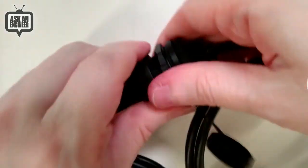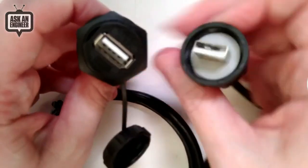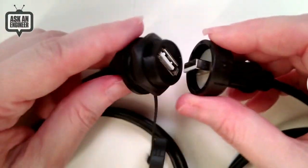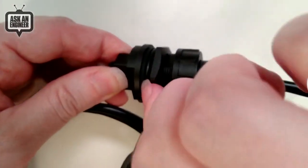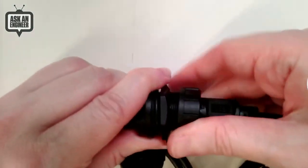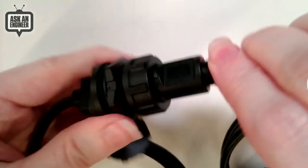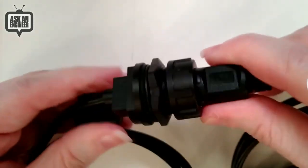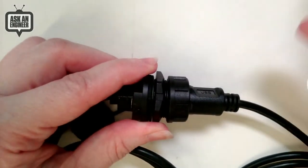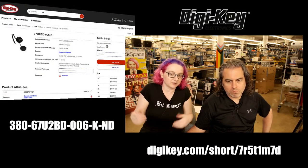So this is a combo. When you unscrew this part, this plugs into here — this would be what you connect on the other side of your single board computer like your Raspberry Pi, for data or power or whatever. You plug it in and there's an O-ring here. Then you just have to screw this in and it gives you water and dust protection, plus strain relief because it's strong and ruggedized. I like that little detail — they have 'USB' labeled here so you know what it is, because once it's in the assembly you can't tell. There's epoxy on the back, and all together it's a very nice cable kit. It makes it really easy — you want to make your project ruggedized, you can use off-the-shelf components, toss these cables in, and you're good to go.